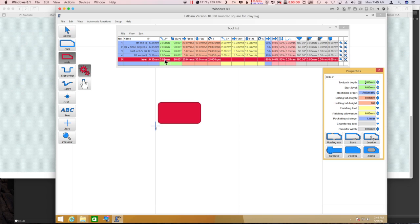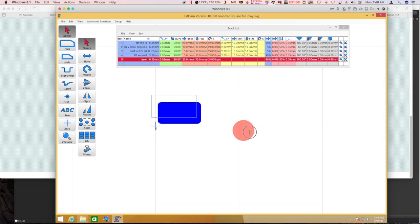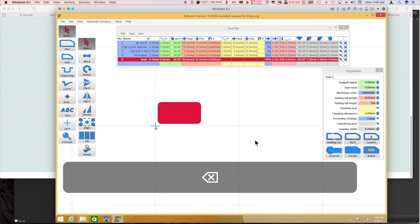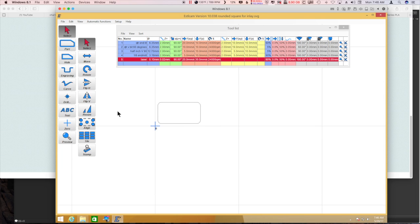Here's the setup I have for the laser. I've got it set to 20 millimeters per second just to start with — we can always adjust it on the control panel downstairs. This is the pocket we're going to make in the wood. I saved that away to a G-code file, and let's go ahead and delete that. And that I'm going to cut into a piece of wood.